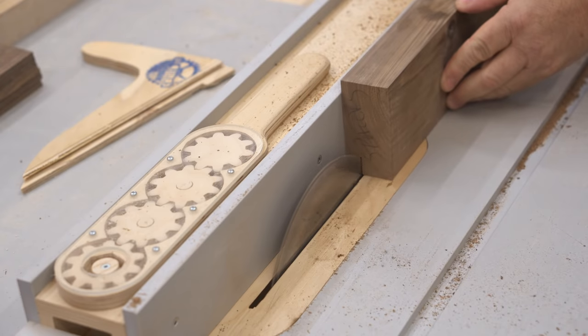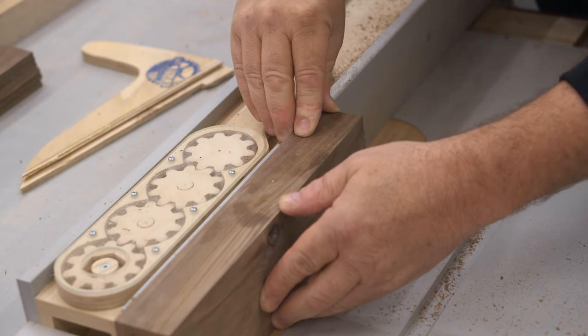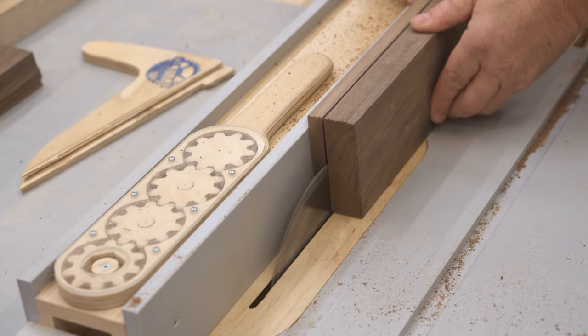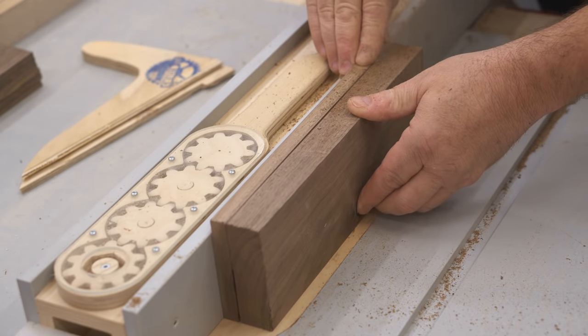The sides of each case are half-inch thick, and that's what I'm cutting right now. This is a different piece of stock though, and there's a lot of drying stress built up. I'm getting a little bit of binding, but we know how to take care of that — run it in until it starts to bind, pull it back out, and recut the kerf over and over again until it cuts right through.